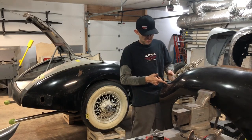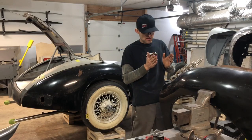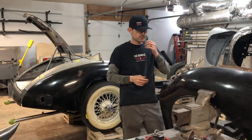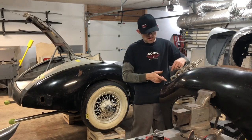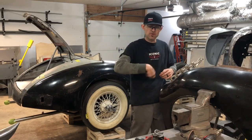What I did is I picked a point on a straight line and I measured from that point over and added how much I thought I needed, or how much I measured on the car. Then I took this piece of sheet metal and I laid it on top, put it on my line where I want it, clamped it down, and scribed it real well.